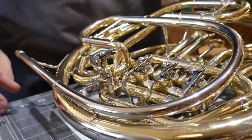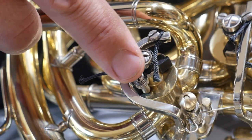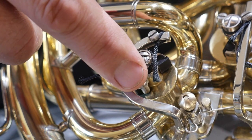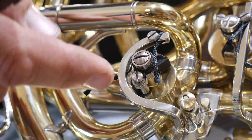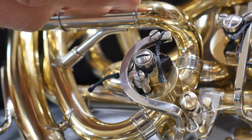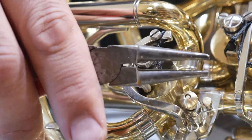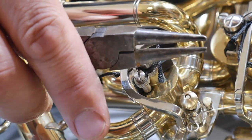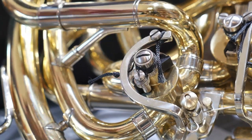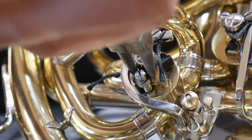Let's take a closer look and I'll show you exactly what we need to do. We're going to grab a hold of this screw — not the big screw but the smaller one — and grab the whole arm that sticks down, that actually rotates back and forth and hits the rubber bumpers. We're going to do that with a pair of round nose pliers. Notice how these are round-tipped and have no teeth whatsoever — not even flat nose — because I don't want to leave a mark on any of this.